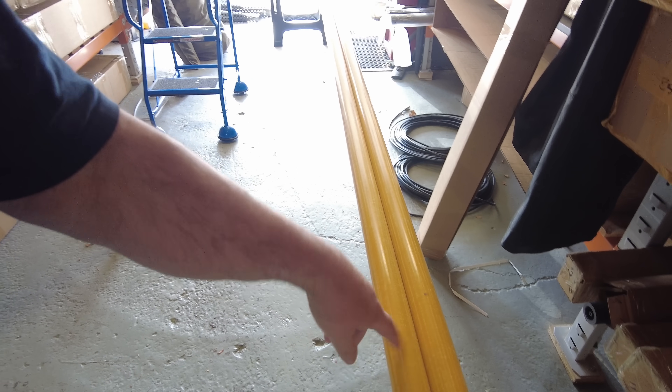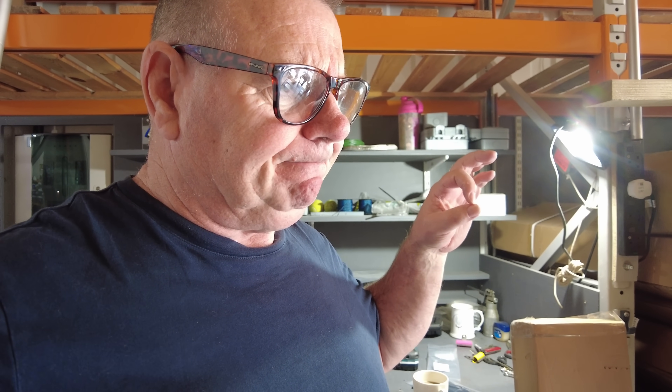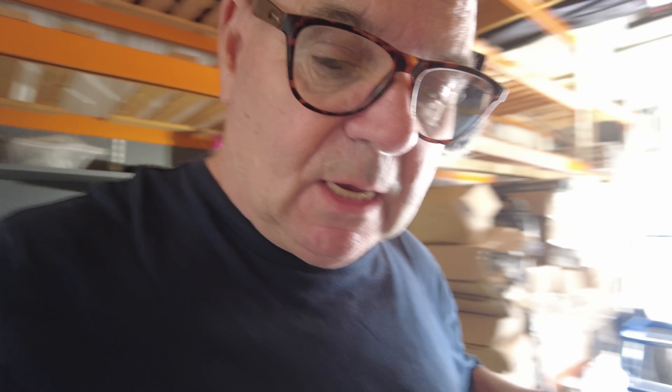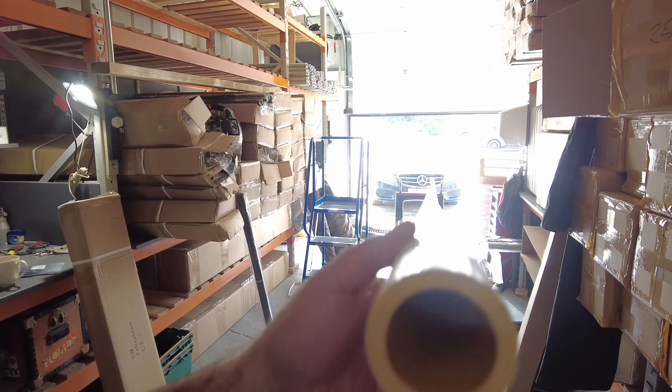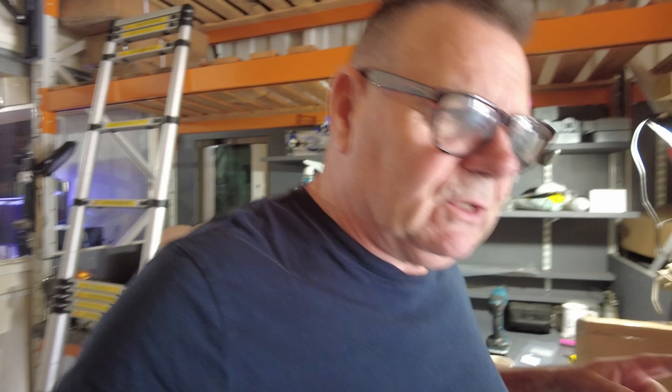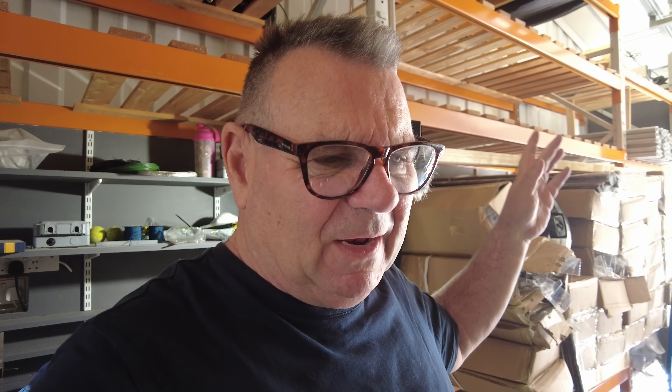It's the beginning of the 160 meter dipole project. I bought a ton of these — they're effectively scaffold poles but fiberglass. They're quite heavy, about six kilos. There's not much bend, which is nice, because I'd like to use one as a proof of concept for a six meter boom for a three element Yagi, although ideally I probably need square section alloy which would be the same weight but more rigid.